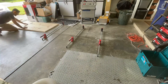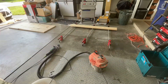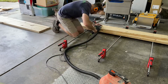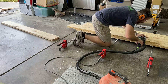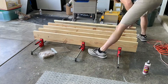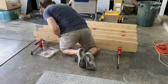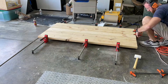Next step is the actual glue-up. I'm using parallel clamps and dominoes — you definitely don't need dominoes, but they help with lining things up. It'd be perfectly fine with just glue. I'm putting 5x30mm dominoes into the sides of the 2x8s. I'm using Titebond 2, my personal preference. This one is a brown color, so if it bleeds through, it won't show since the project is being stained espresso — a dark brown.